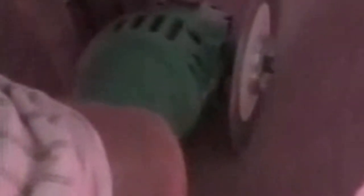Since the Caesarstone pattern is being used here, 10-inch borders will be installed, as well as bands in the center of the drive, to provide some contrast to the unbroken texture of the Caesarstone. This is accomplished by taping paper shielding on these areas and troweling on fresh material, which will remain smooth and texture-free. The following day, we applied Superstone SuperSeal — and by the way, Superstone Clear Concrete Sealer may also be used. Now we can see the dramatic change in appearance from this to this.